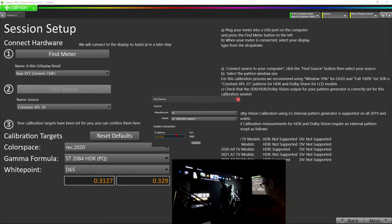Optimization is complete — you are ready to begin. Go over to the Direct Display Control. Check BT 2020 HDR and the gamma formula — both correct. Remember RGB range should be limited, as we set in the PlayStation 5 and LG C1. Calman officially recommends limited range, luminance level video 16 to 235. Under AutoCal Targets, make sure your Delta E formula is DE_ITP. Set both Delta E formula fields to DE_ITP. Everything else can stay the same. Then hit Next.